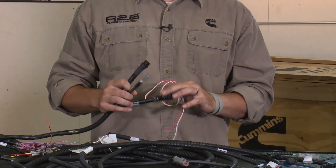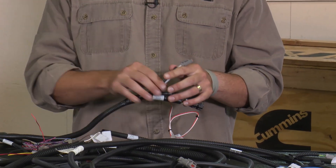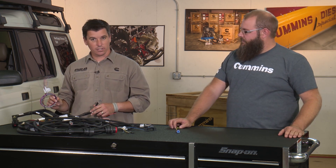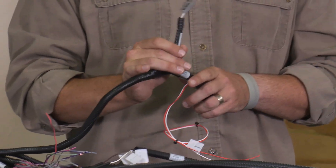This is a wiring harness from PCS. This is one that I'm using on my build and it is for a GM 6L80E transmission — that is a smart transmission. It needs data from the engine, it needs throttle position sensor and all that good stuff, which for some applications you can use this, but if you have a CAN bus network you can use these two wires.